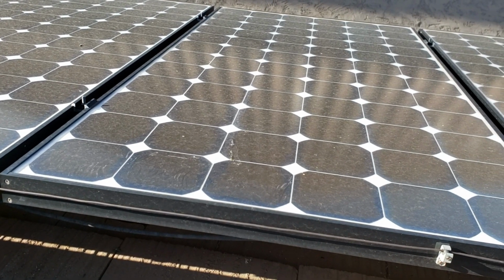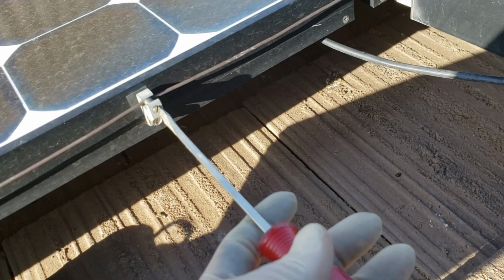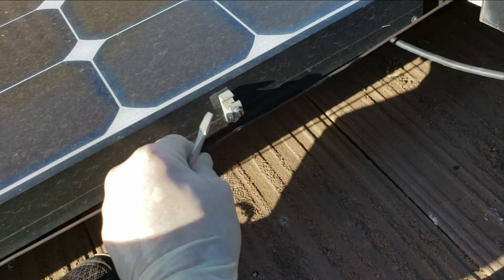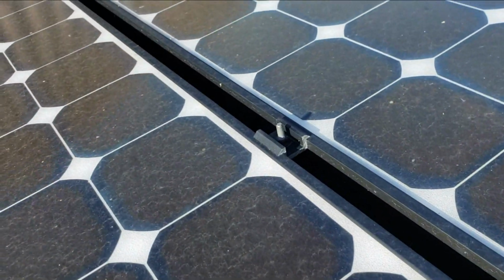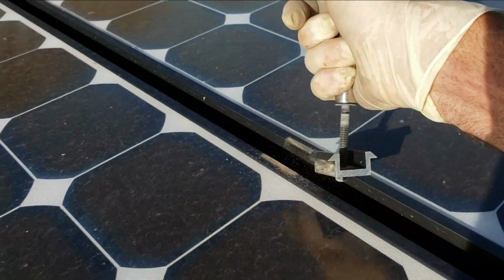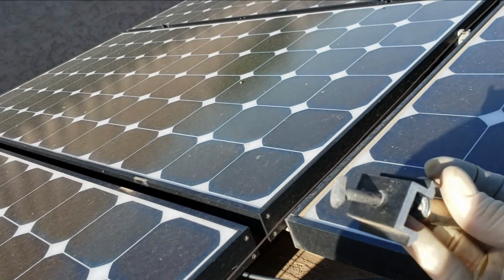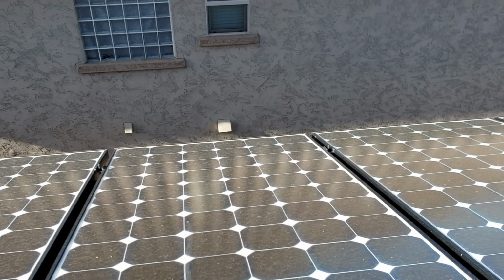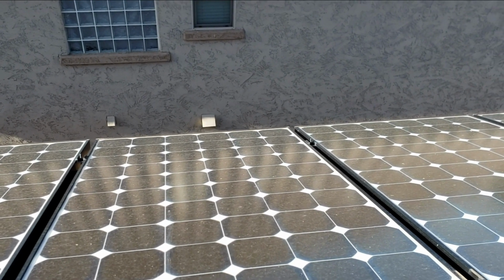And it's gross. So the first thing I have to do is take this grounding strap off this panel here so I can actually move it. That should be enough. Alright, so that's clear. The next thing is to loosen up each one of these bolts. It's just 11 millimeter. The whole thing comes out pretty easily. Just repeat that 3 more times carefully, especially on those last 2 down there. I can't film and do that. So hopefully I won't fall off the roof next.